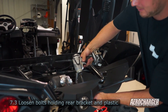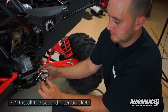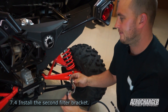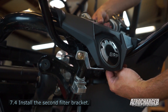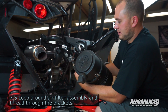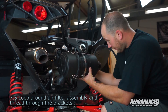Now that those hose clamps are tight on the bracket, take out the two 13mm bolts. This bracket is angled as well — make sure it's facing down. Your Donaldson is going to set up against it. Put the plastic blocks on the back side — don't lose them; there are also some on top. They'll probably fall out when you take those bolts out, so be careful. Tighten them down, slide your big hose clamp in here, and toss it up in the hose clamp. Remember that orientation is critical — always want the drain facing down, and our charge tube comes out here towards the front.